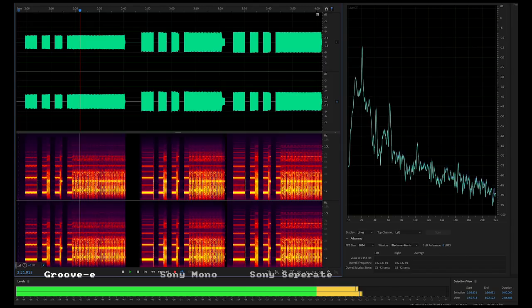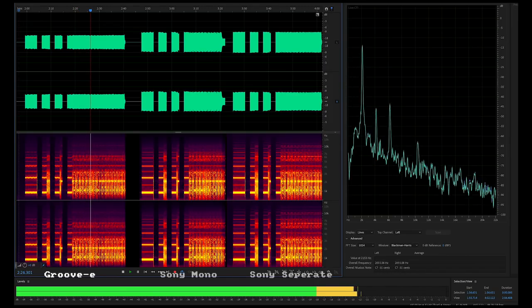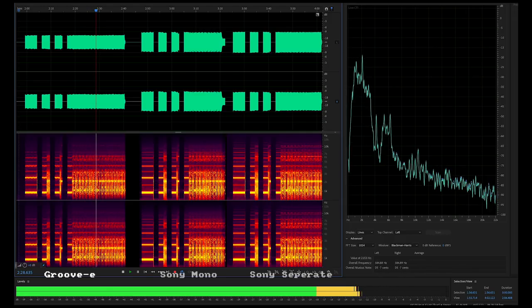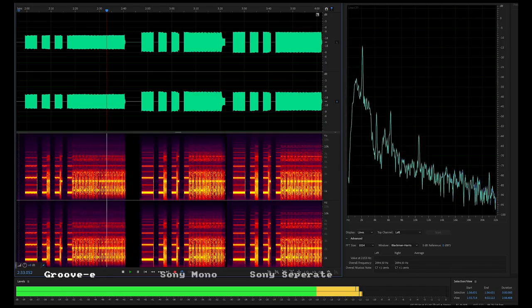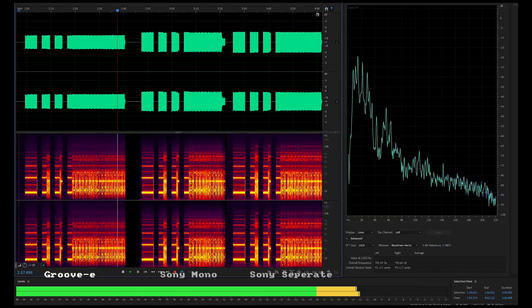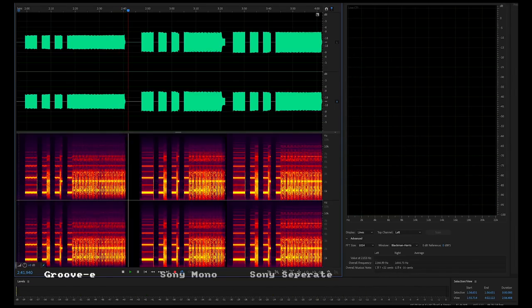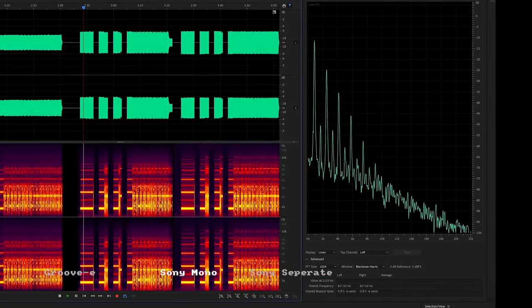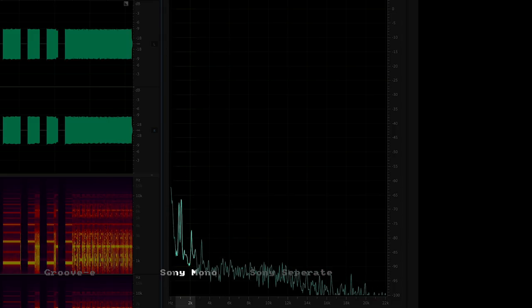Fidelity isn't important for computer cassette recorders because, on the Spectrum certainly, my understanding is anything below 300 Hz gets cut off, as does anything above 5 kHz. And a Spectrum loading signal is essentially two tones flipping between 1 kHz and 2 kHz that swap to represent 1 and 0. If you look at the graph, you can see that. Everything else is just harmonics. See, it just flips 1-0, 1-0, 1-0 between 1 kHz and 2 kHz.